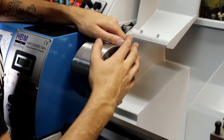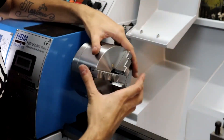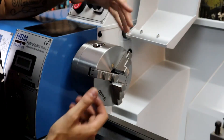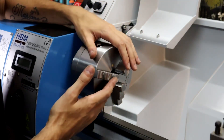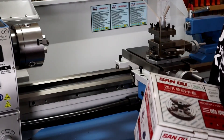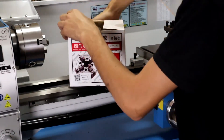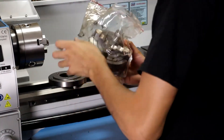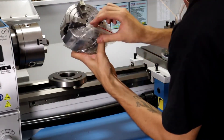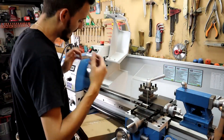The lathe comes mounted with a three-jaw self-centering chuck, and besides that it comes with reversible jaws, which allow you to hold a larger diameter piece. This particular lathe and the vast majority of lathes from the Tecnomachina website also comes with a four-jaw independent chuck. They are four-jaw independent, which is something we'll use a lot and that offers many possibilities.